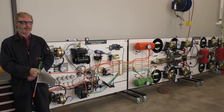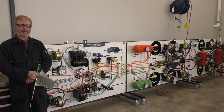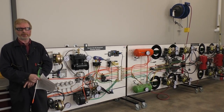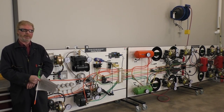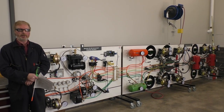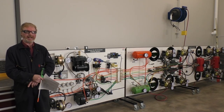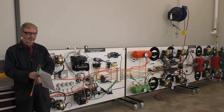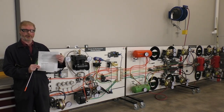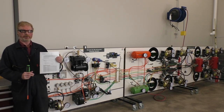Okay, good afternoon. So here's our next video for your lab objective, and this is going to be lab objective number 12, which is the Bendix ABS, or anti-lock braking system, ATC, automatic traction control, and ESC, electronic stability control, trainer board. Now, you've all seen this in lab. So the first thing we're going to do is have a real quick orientation on some of the parts and components. Then we're going to do some measuring, and then we're going to take a break, and then we'll get set up again, and we'll go into the actual Bendix ACom software for the diagnosis, okay? So this worksheet is going to be posted on Brightspace, and we'll be working through each of the individual lab objectives through the sheet from start to finish, okay? So follow through the video with your worksheet.